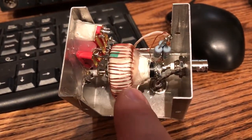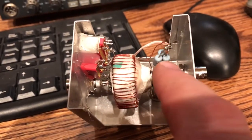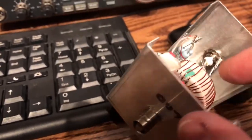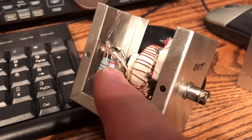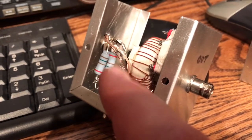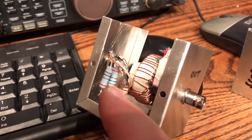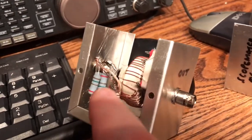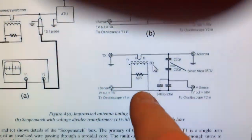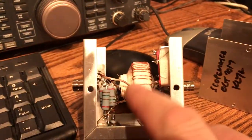This is 50 turns. The output of this is across these resistors here — three 150-ohm resistors in parallel to produce 50 ohms. We do a bit of current dividing here where there is a bit of dissipation. We really want to make sure these don't get too hot and change resistance. So these three resistors are the 50-ohm load across the output of the toroid.